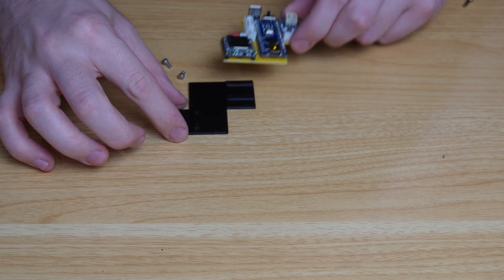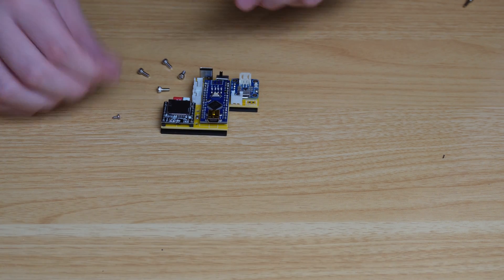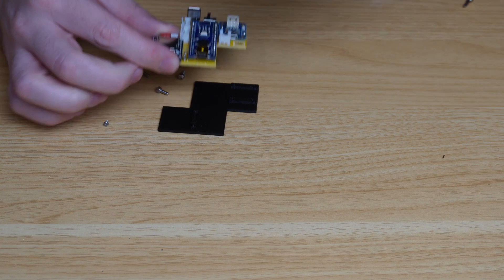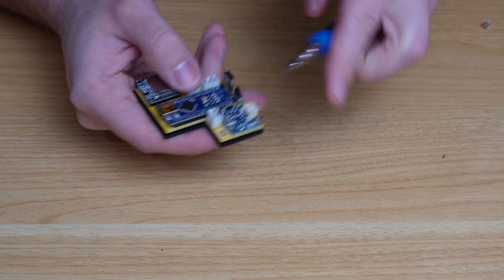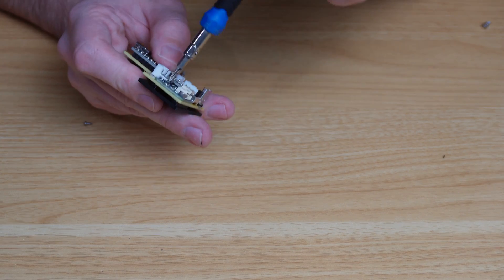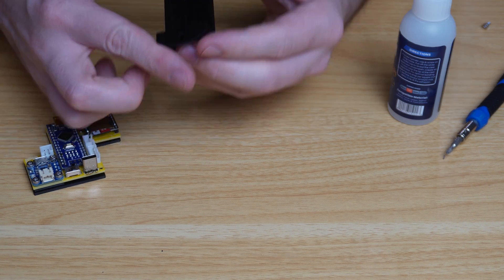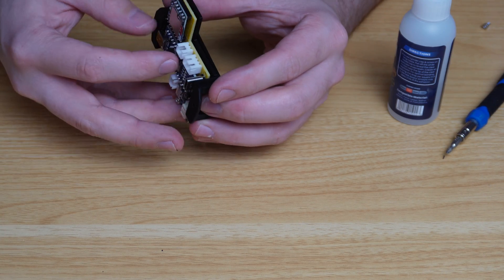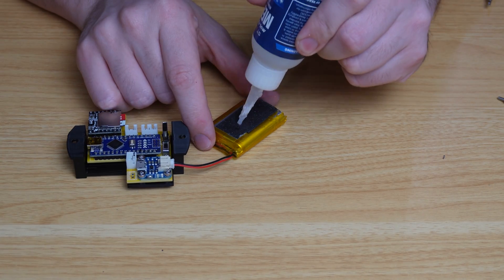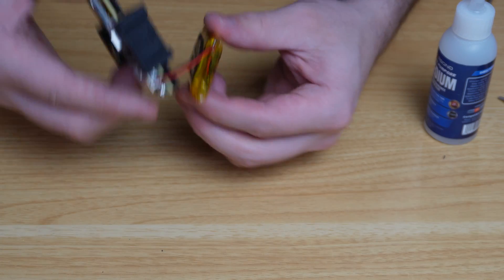Let's assemble the Stratagem Ball and install all electronics inside. Take the PCB mount, grab the PCB, and screw it down using tiny M2 machine screws directly into the plastic, then M2.5 screws for the LiPo charger portion. Take the modified battery mount, apply a little glue, and glue the PCB mount to it. Then glue the battery — or an elastic — directly behind the modified battery mount.